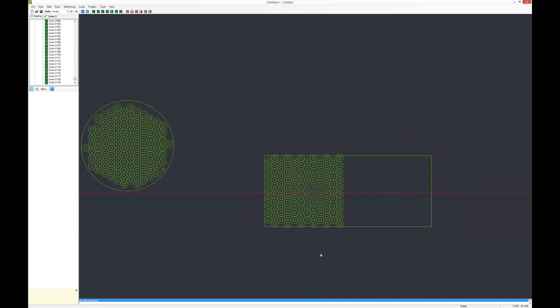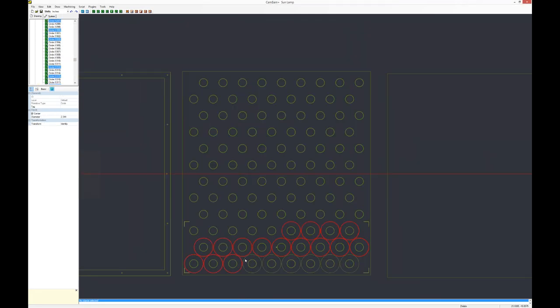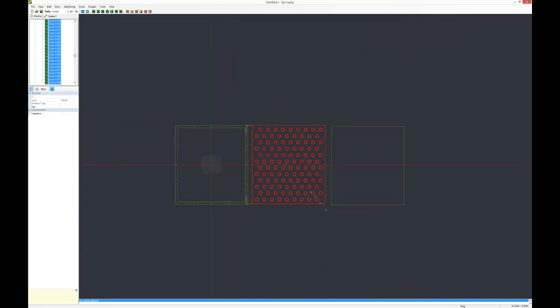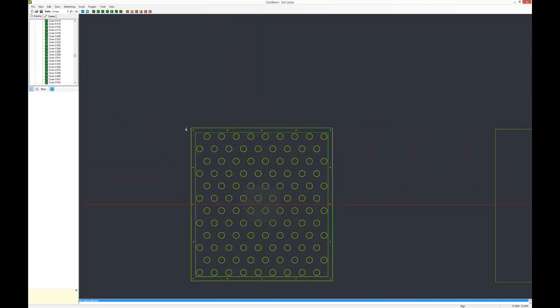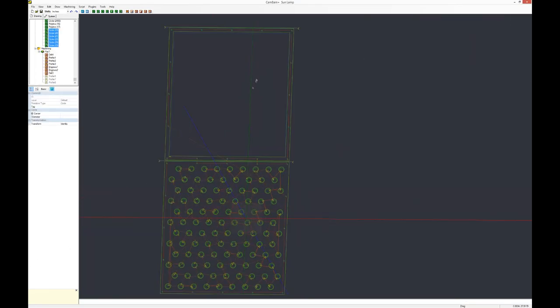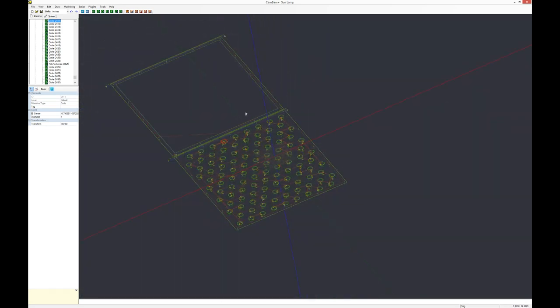So I hopped onto my machining software called Cambam to design the enclosure that would hold all the bulbs and to create the G-code that would run my CNC machine. I'd initially wanted to make the enclosure round, like a sun, but it was difficult to densely pack the bulbs and have the pattern of their placement look symmetrical. Also, round designs increased the width of the material needed by at least 6 inches. For these reasons, I went with a simple rectangle.